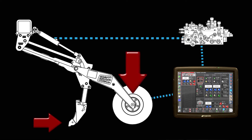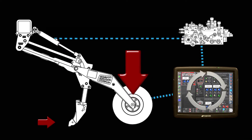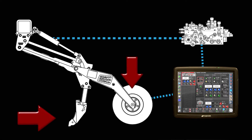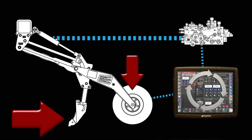If there's less draft, the shank pulls lighter, which would increase the packing. Pack Master drops the packing pressure off on the wheel so that it maintains that consistent pack across the field. If you get into a hard pan in the field where there's increased draft pressure, it simply tells the hydraulic system to increase pressure so that it maintains that same pack.